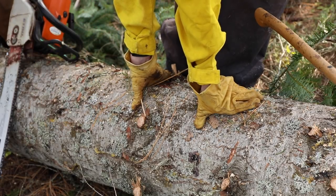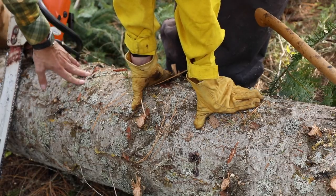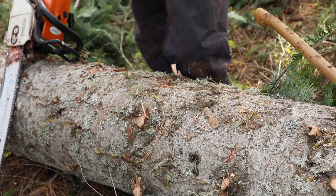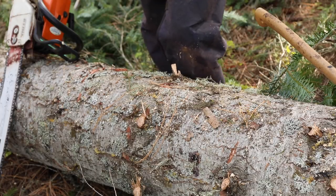So that's still a good sized timber. We could get a 10 by 10 out of that. So let's go ahead and make your buck. Now before you do that though, I want an assessment of what the hazards are and if you're going to be in compression or you're going to be in tension on this buck. Okay.